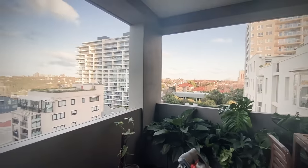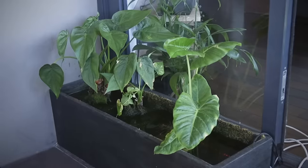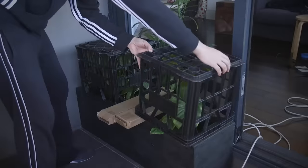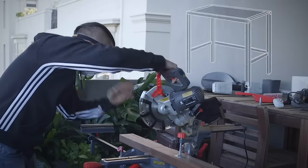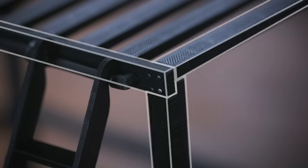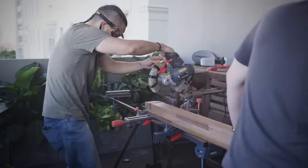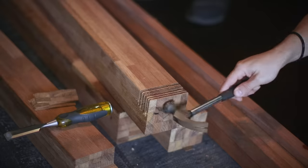Day one - time to convert my balcony into a wood shop with a $150 Bunnings mitre saw. I don't think my fish will enjoy sawdust any more than I will. Safety first. Starting with the loft bed, cutting the posts and the bearers. The next step was to trench cut the top of the posts so that the bearers would slot into the trench. I did this using about a dozen parallel cuts at the top of each post, and then chiseled out the remaining wood until it was smooth.